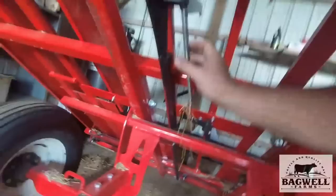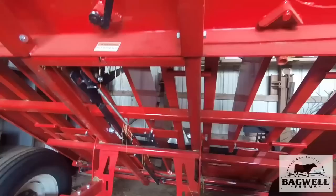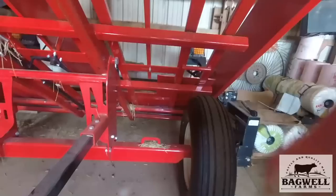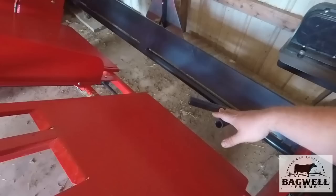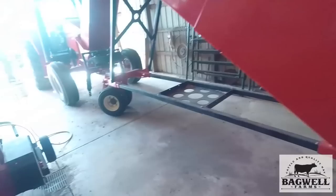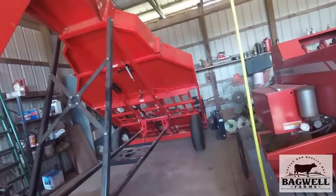This here's your trip lever — it's got a little tab, and when that lever down there is hit this will pop over, which hangs that to pull it downward to release it. Another thing: when you're baling you can watch through these holes to make sure your bales are turning — you can see where the hay is at and know if the bales turned right. This is just for the 10-bale model; they've got a ton of different patterns. You can see if the hay is backed up or not whenever it throws that bale down. It's very simple but it's also a little bit of a pain to get set up.